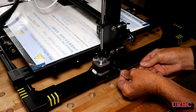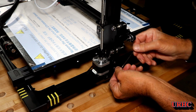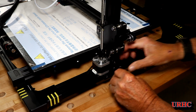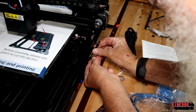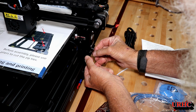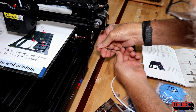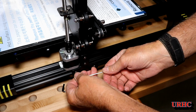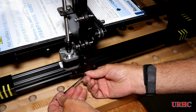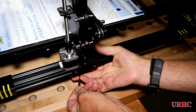So then I put these side brackets on. This is the first one. They have the screws and little T-nuts on them already. You just hold them in place and turn them, and they lock in place. If you follow the instructions that come with it, it's real easy to put together. And there you can see, you just line the T-nuts up in the right direction, and once you start tightening them with the hex wrench, they actually turn and make sure that they lock in place in the extrusion there, and everything's set to go. And it was time to go back and just tighten all these up and tighten up those other vertical bolts, make sure everything was good and snug. And it was good, snug, and it was all nice and square and everything when it was together.